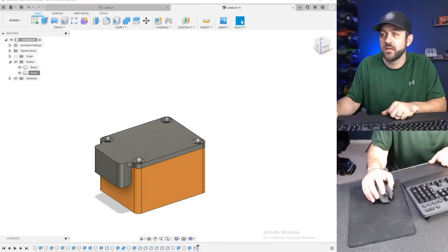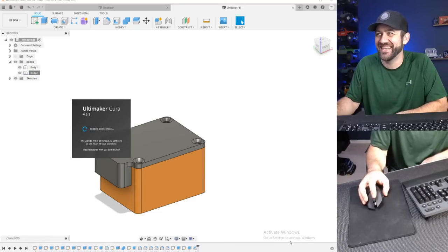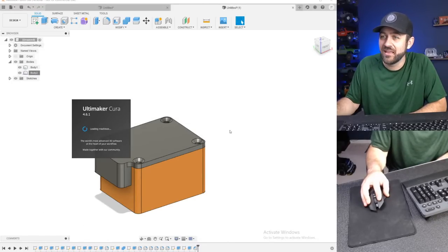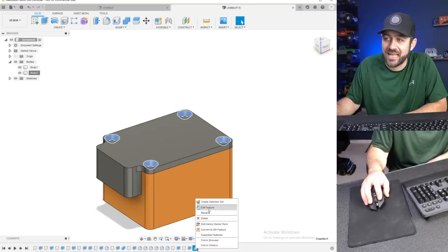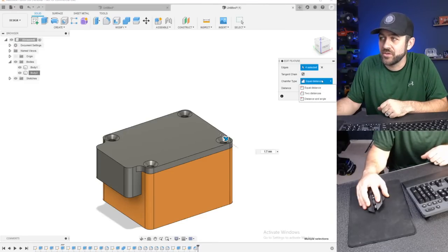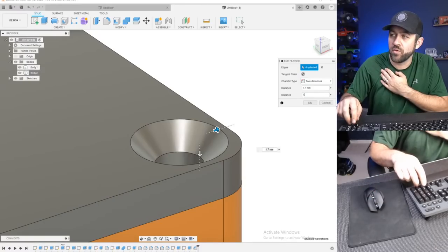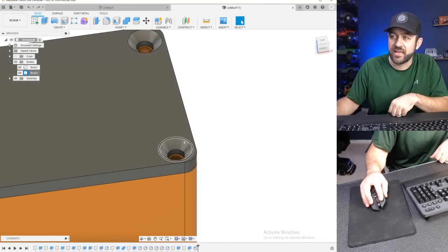Then you could take that and import those files into your 3D printing program. Let's open Cura just because — still need to activate Windows on this computer. In here you would hit open, select the two files that you plan to print. If you plan to print them at the same time, I would take this lid and rotate it 180 degrees. That's pretty much all I would do — I would print them like that. You wouldn't need any support material, nothing fancy. You would just hit slice and export that to your printer.